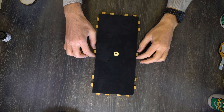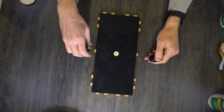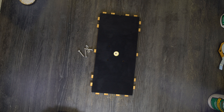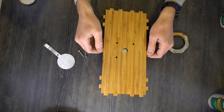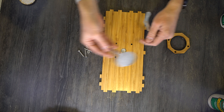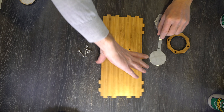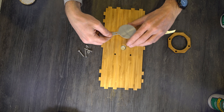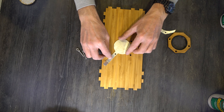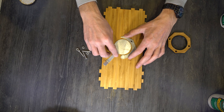Now it's time to start the actual camera assembly with all the felt liners in place. We're going to start with the front of the camera and install the shutter — three nuts, three bolts. Here's the shutter mechanism. We're going to flip this over; there's no hole here so the lollipop can work as a hinge. If you hold the shutter mechanism with the holes in this alignment, the lollipop goes there and the half moon goes there.